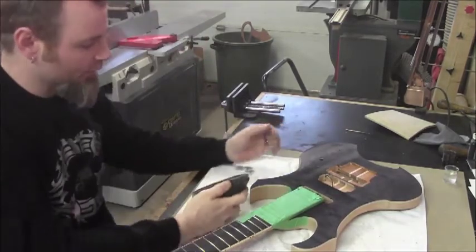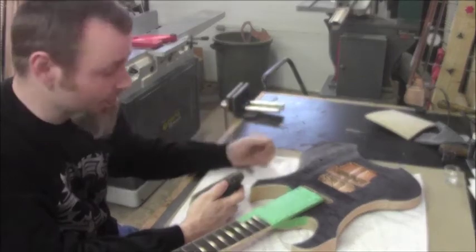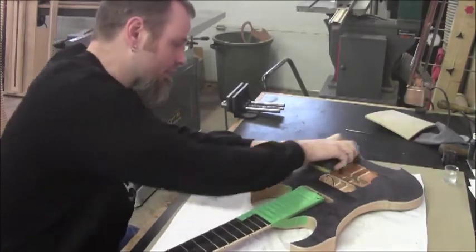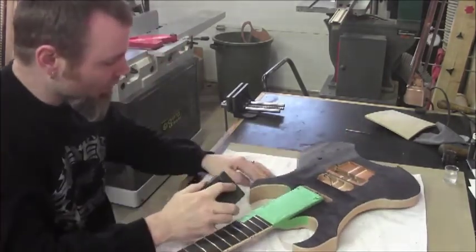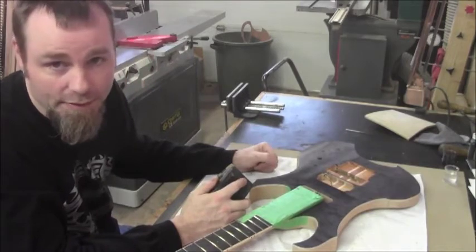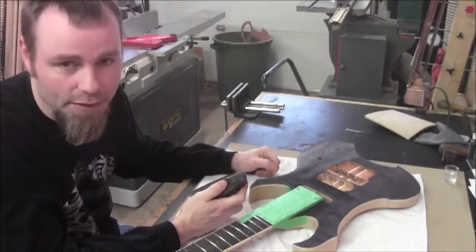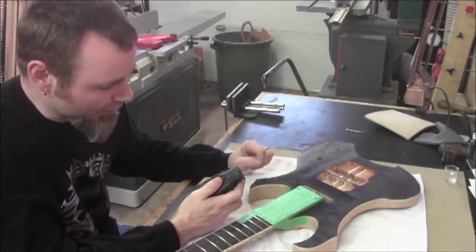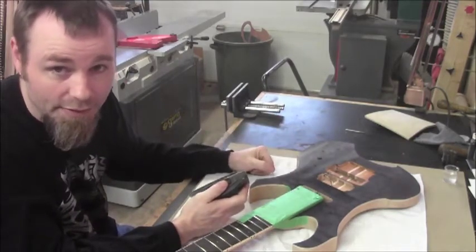What we're trying to do is sand most of this off, but we want to make sure we leave some of the stain in the end grain, which gives us that ripple effect. It'll take a little while, especially doing it manually like this. Some guys will use a random orbital sander, but I like to have more control — if I come to an area that needs a little more attention, I can concentrate on that area and take off a little bit at a time. Doing it with an orbital sander, you kind of have to get in and get out and then switch to a sanding block anyway.